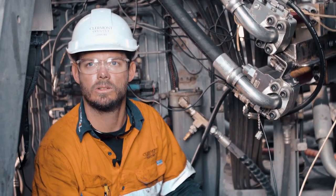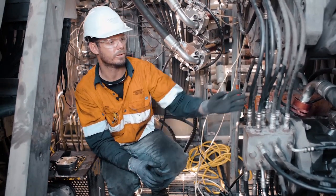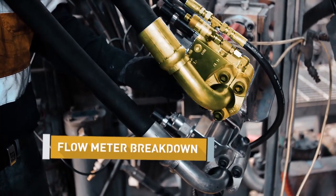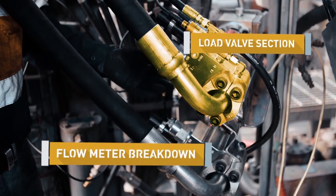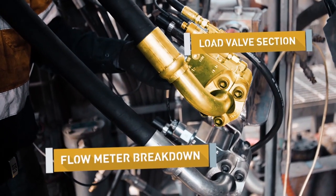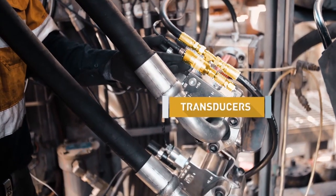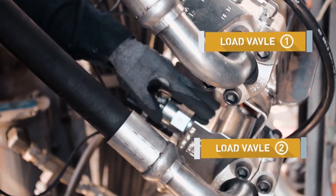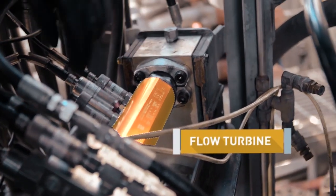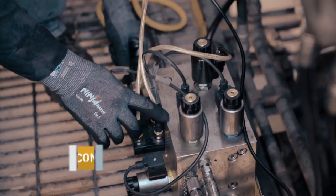We can currently data log eight channels of pressures or flows. Once it's set up, we don't have to come back in except to adjust the regulators. This is the main part of the load valve section of the flow meter — designed to take the place of the manual flow meter setup — with the main relief valve and proportional control. Transducers check main pressures during testing. The flow turbine at the back measures the flow rate of oil travelling through the system, and we can also read oil temperature and pressure in that section as required.